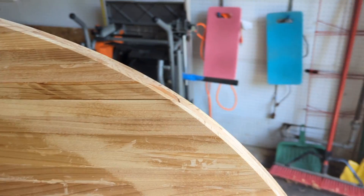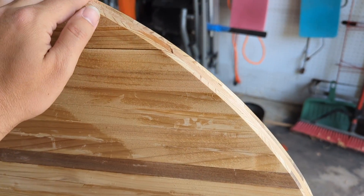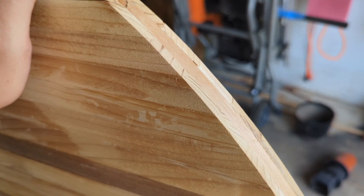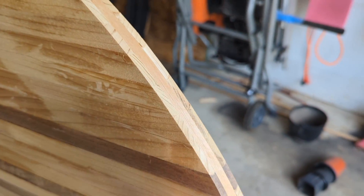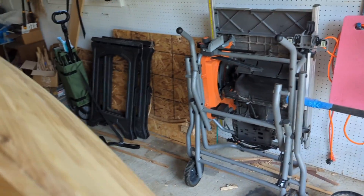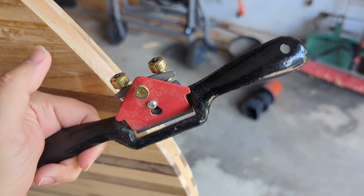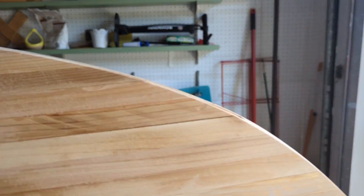Before, I had just used a saw to cut the ends of the strips off kind of as I was going. One thing I didn't really show until now — I went through and smoothed out this edge to fair it up a little bit. I mainly used a spokeshave for that job. We obviously want a nice smooth curve, because of what happens next.